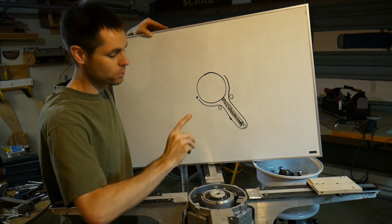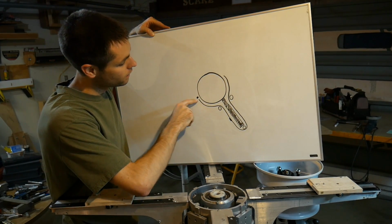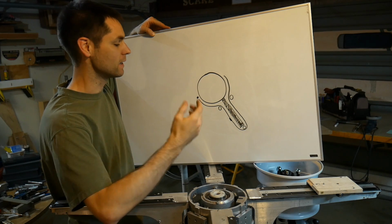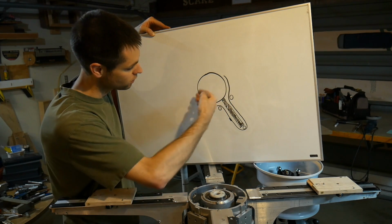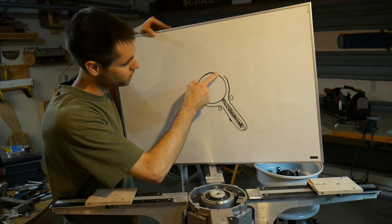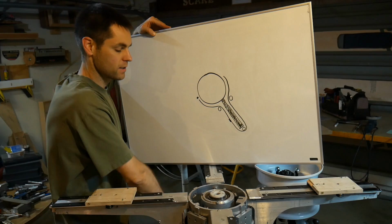So even if you were to use a push cable, which had the 10 inches of extension that you need, 10 is just an estimate right now, it's not going to wrap around here, right? You're sort of pre-buckling it. So if you started trying to push it around a curve and it's exposed from its housing, it's going to want to buckle this way. So that's another reason why I wasn't feeling that great about the push cable. But a cable under tension, if this is under tension, that'll stay wrapped. This will redirect. I feel like there's a lot of benefits to this cable thing.